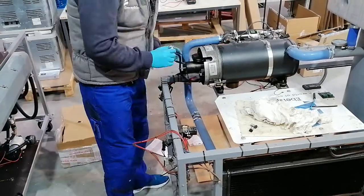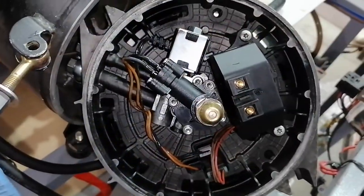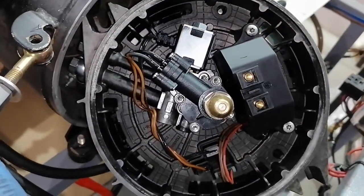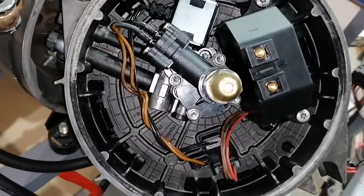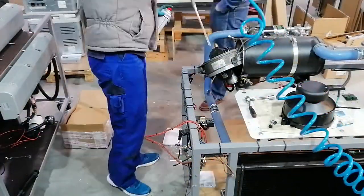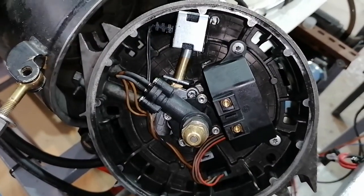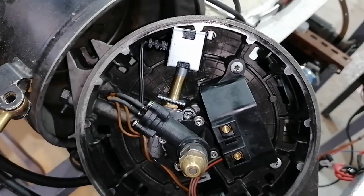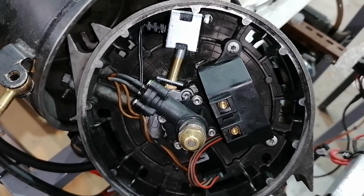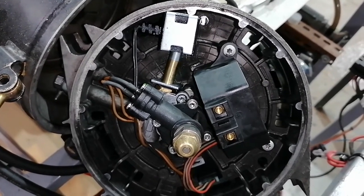the wire harness and the temperature sensor so we can start the unit. I removed the baffle plate and the electrodes just to have a better view inside the unit. Before starting I will clean the head so new leaks can be seen easily. Maybe you noticed that I moved the coil from the solenoid valve to prevent it from opening, so fuel only comes through the nozzle if it is not closing as it should.